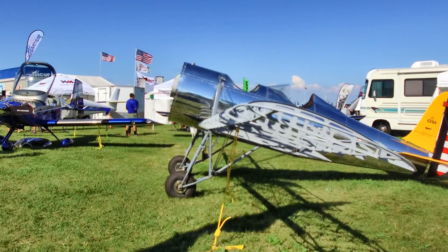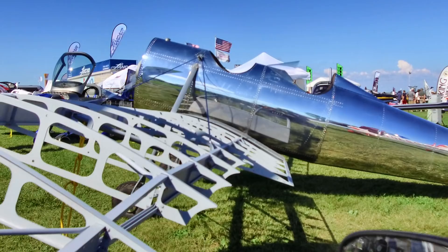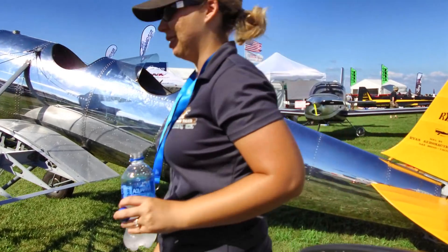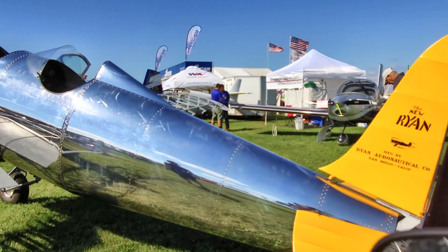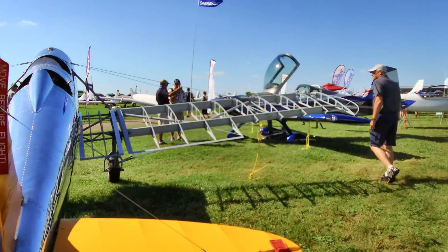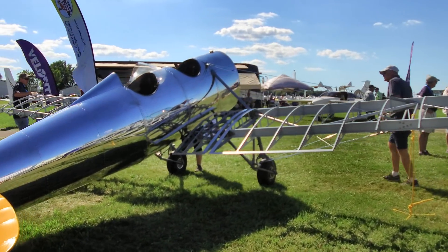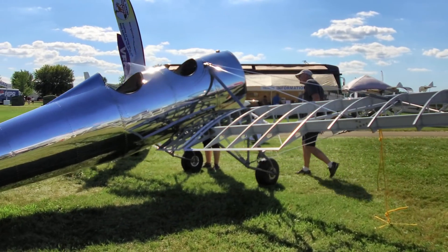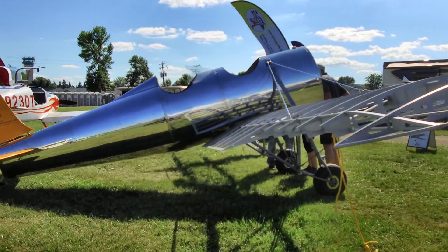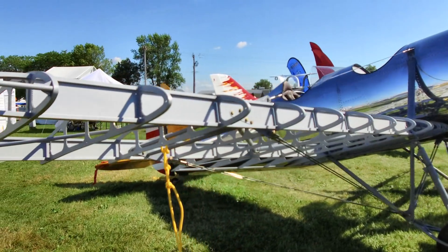In that day they wanted to cover everything with metal because that was the new thing, and he said, well let's just cover it with fabric - we know that and it's a lot lighter. We basically took the airplane and redesigned it from the ground up. Externally it's exactly 95% scale. We have original blueprints and we use those to get the proportions just right. It's an extremely complex airplane to build until you start looking through the drawings. We wanted to take all those complex items and make the airplane simple. We got rid of the drag anti-drag wires and used a drag truss instead.